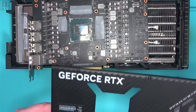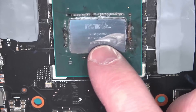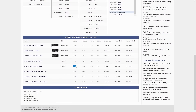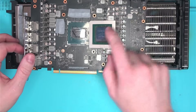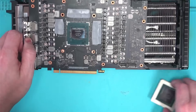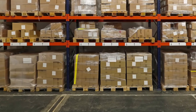The most interesting part about this GPU is that the sticker with the serial number claims that this is a 24GB 4090, but judging by the label on the core itself and matching it up against the TechPowerUp database, this is a laptop version of a 4090 core that only supports 16GB. This is what a normal 4090 24GB core looks like — why it's not there, I don't know. My best guess is that it's a 4080 PCB with a 4090 laptop core that, according to its owner, came as part of a pallet deal from Amazon Returns.